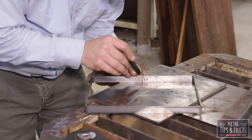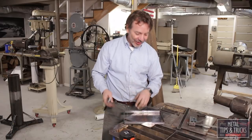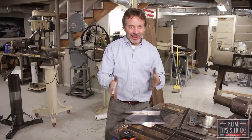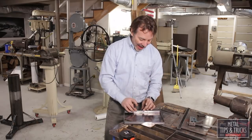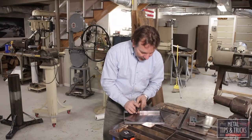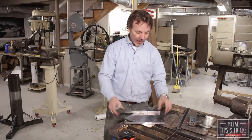We're really close to 37, so that's not too bad. It didn't stretch too much. I've had this stretch quite a bit. Things always move around. So it looks like we're going to be able to cut these all at 38. And we'll end up just lining this up, cutting it off with a cutoff wheel, weld that seam, and then attach it to the plates.